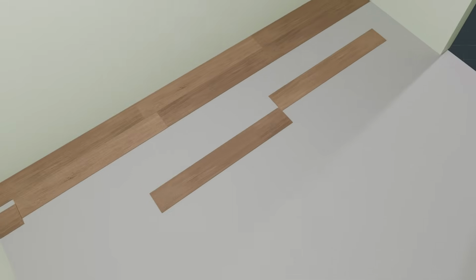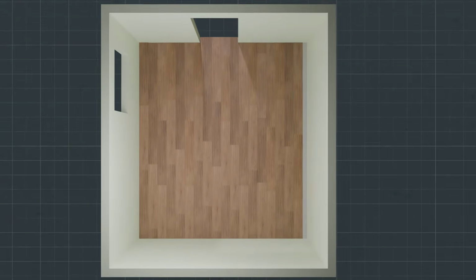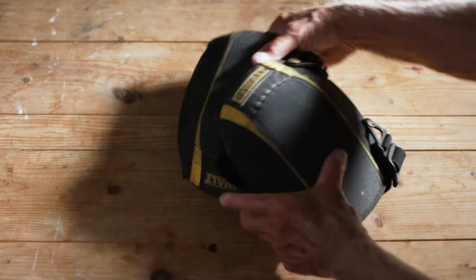Now let's design our layout. Lay your boards in a staggered pattern, laying offcuts at each new row to minimise wastage. Try to leave at least half a board gap at the width edges. You'll likely want knee pads for comfy working.